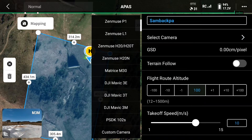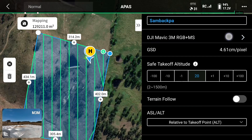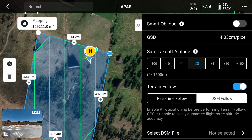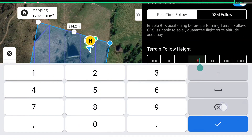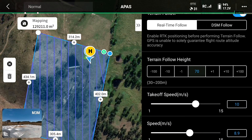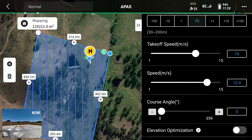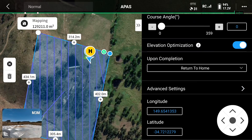We're going to select your camera and your M3M. We're just going to do RGB today. We're going to want terrain follow on — real-time terrain follow — and we're going to bring it down to about 70 meters for this job. 80 meters is pretty good; anywhere below that you're starting to get a higher resolution, which makes it easier for plant ID. We're going to put our flight speed up fairly high today, and you want elevation optimization clicked on. This gives you better readings on your elevations, so your Z-axis becomes more accurate when it comes to your actual spray mission. Very handy if you're working with a gully — it creates a more accurate 3D model.